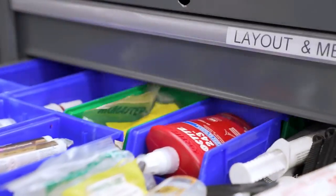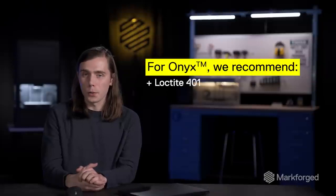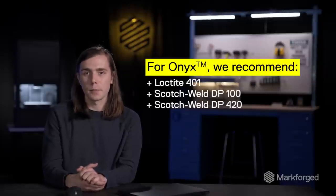One thing to note with adhesives, you're going to want to do some research on which adhesives work best for your materials. If you're using a Markforged printer with Onyx, we recommend using Loctite 401, Scotchweld DP100, or Scotchweld DP420. For other common 3D printing materials such as PLA, PETG, and ABS, good candidates include cyanoacrylate adhesives, epoxies, and silicone glues.